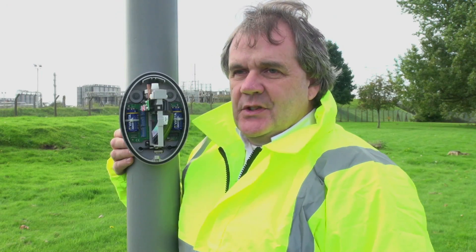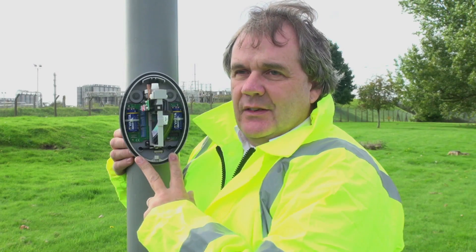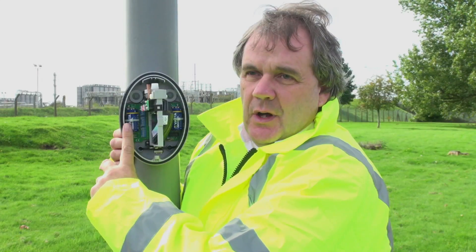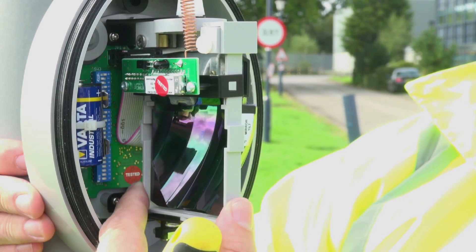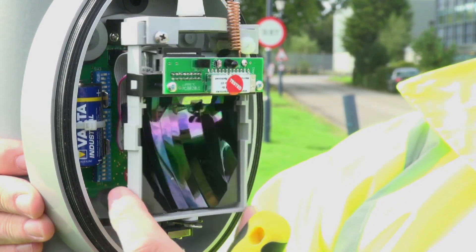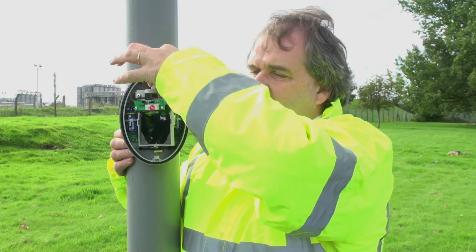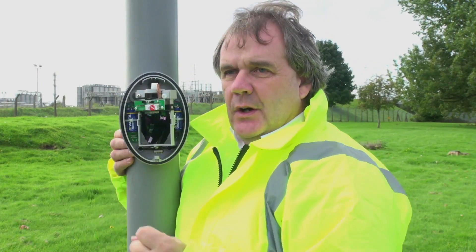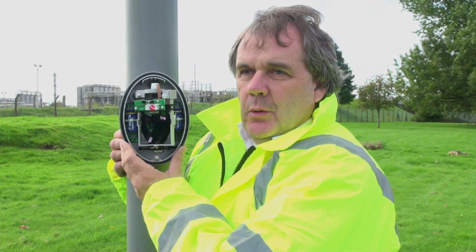This is our second detector position and this is a Genesis 2 60-metre narrow beam detector. Prior to mounting it I've set the option switches to power the unit on and set its unique address. All I need to do now is do some rough pan and tilt adjustments. The unit will pan through 180 degrees, so I'm just going to roughly set it and roughly tighten the screw. We've also got a tilt adjustment that gives us our overall distance. Now all I need to do is put the cover on and we'll do a walk test.